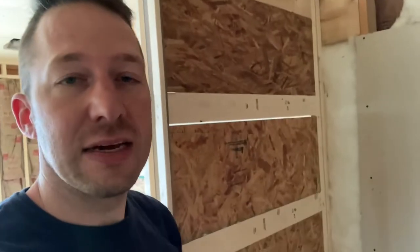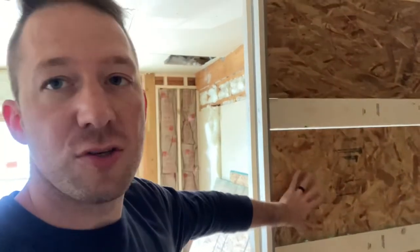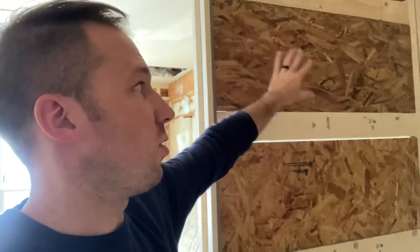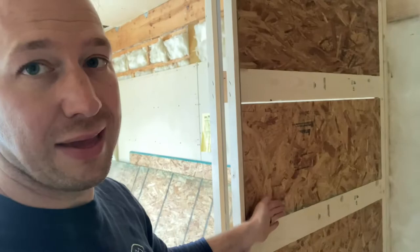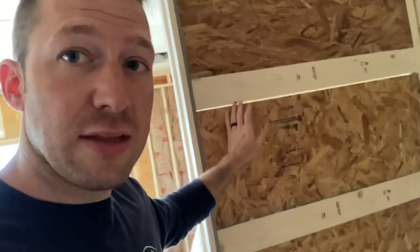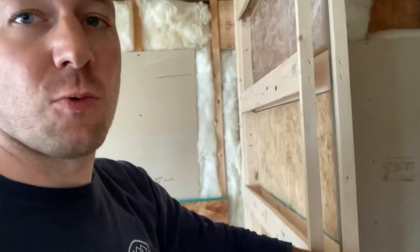So I'm pitching an idea — this is something I read online at a group forum. I've also added this three-quarter inch plywood right here to help fill in this space so that these aren't carrying it alone. I'm going to cover all of this in glue and add another sheet of half-inch OSB on the outside of this, spanning from the floor all the way to the ceiling, tying all of that together. Since it's glued and screwed, I think it's going to add a lot more rigidity. That's also going to give us some room to put in a grab bar here, and then the backer board is going to go on that. I think that's going to be enough to make this a really stable wall.